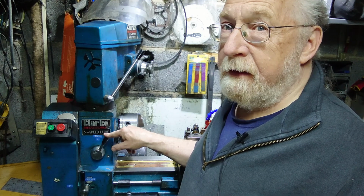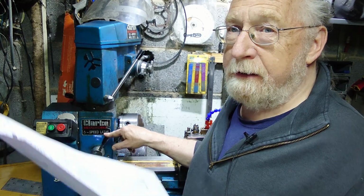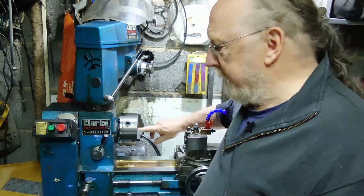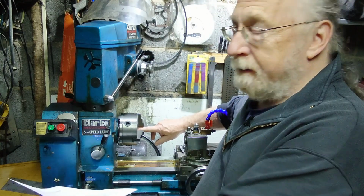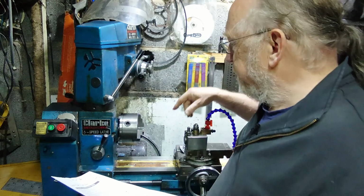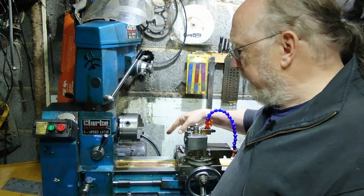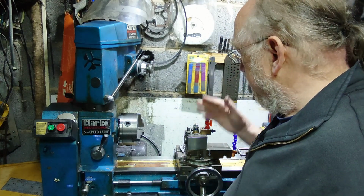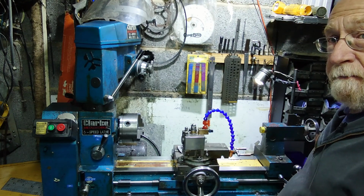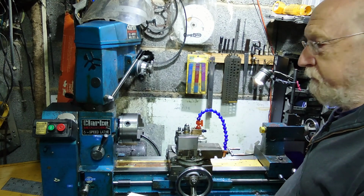So for the guy who asked the question, I'm sorry I forgot your name, I'll add it up possibly. If you've got your shaft in here, where I've got my finger, don't worry, there's an interlock here. The door's open, it's not going to run, look. So your shaft is in there, you're running your metal onto your shaft, and you want to drive your carriage forwards so that it's winding the wire on to give you your compression spring.